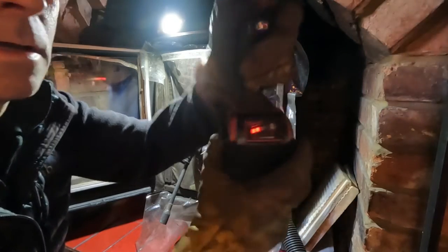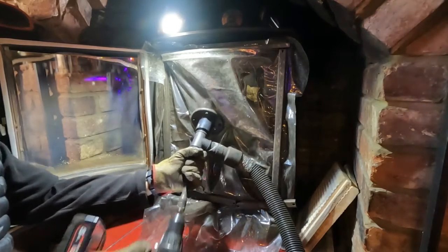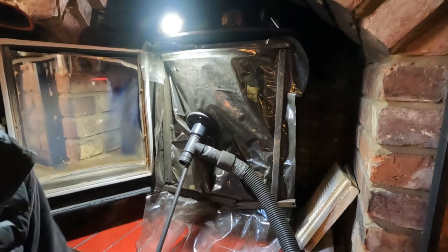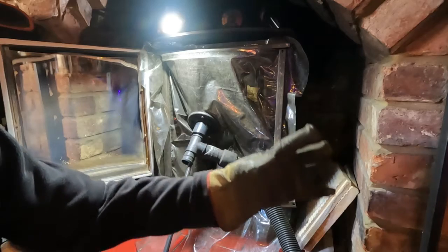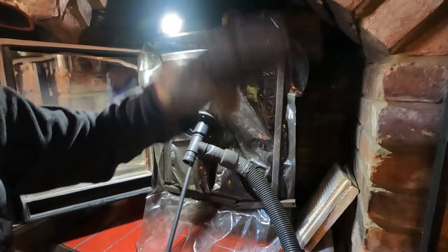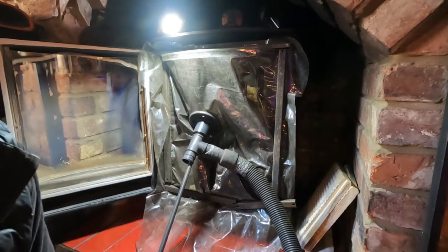The drill work. Two bars left. So if you're using a rotary brush, especially the thick stranded ones are quite good. When you're in the cowl, of course the brush opens up, when you rotate it in the cowl, it cleans the mesh off. But when you bring it in spinning, it sits on top of the liner where you go from the cowl to the liner, and you can feel that, which is a good indication you definitely got to the top.